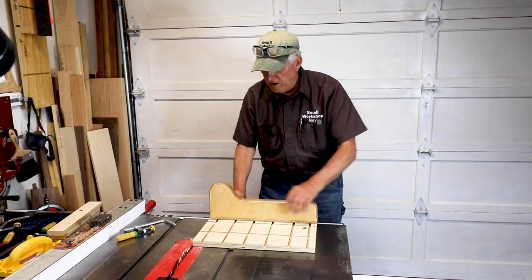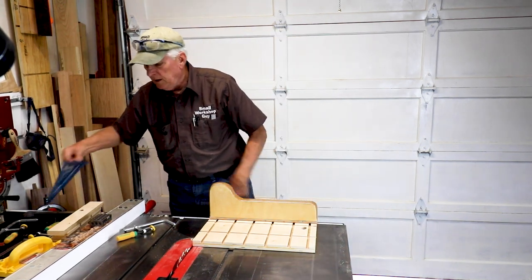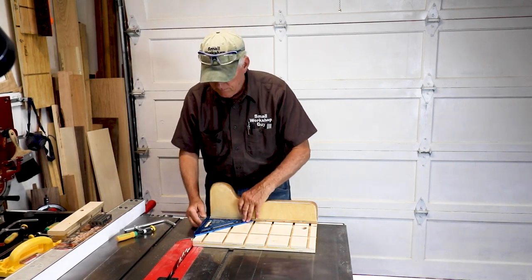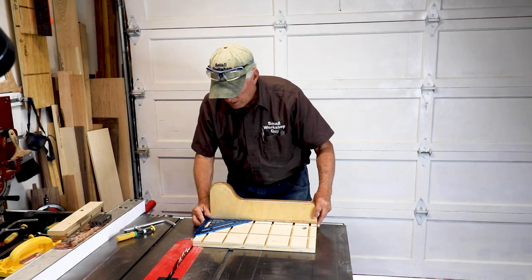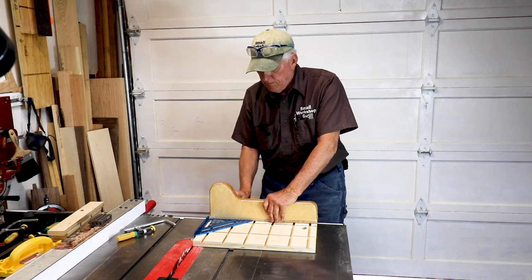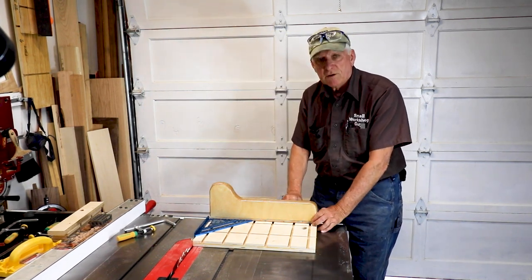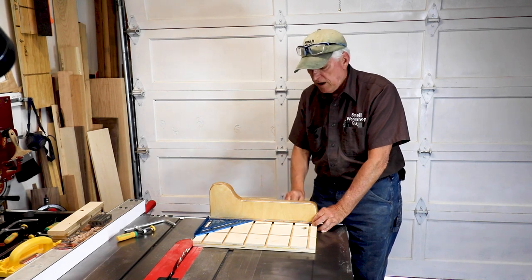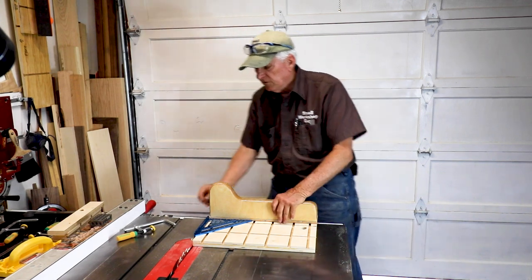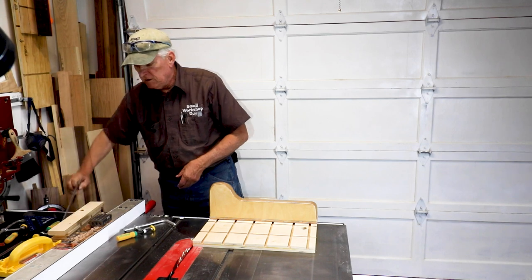Since this is a flexible fence, I have to set it if I want a 90-degree cut, although for a lot of cuts you're not really that worried about it. But since it only takes a second, why not? I've also got the bigger sled, which is designed to have a fixed back fence that gives a perfect cut using the William Ng 5-cut method.